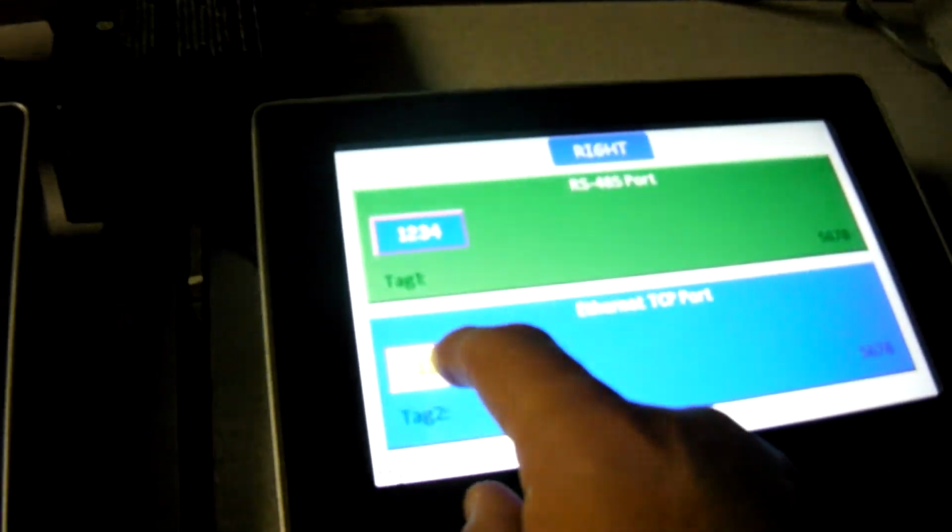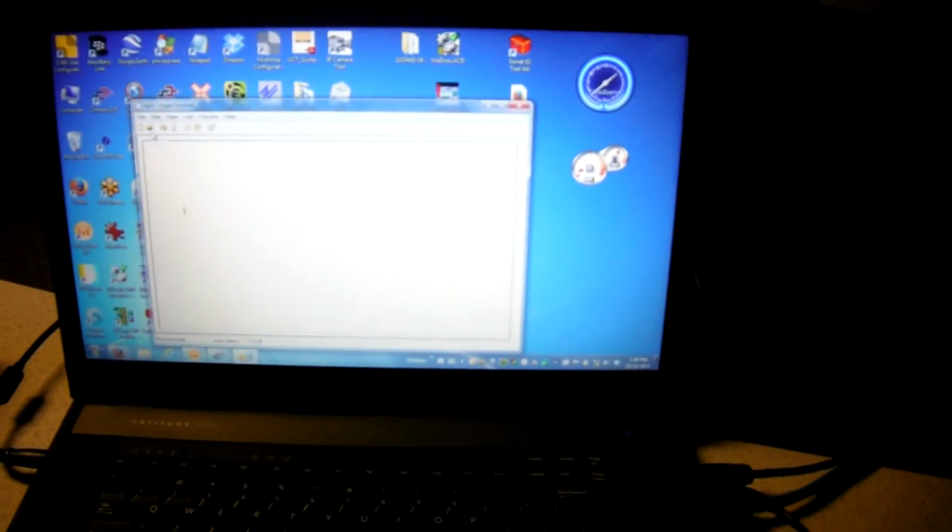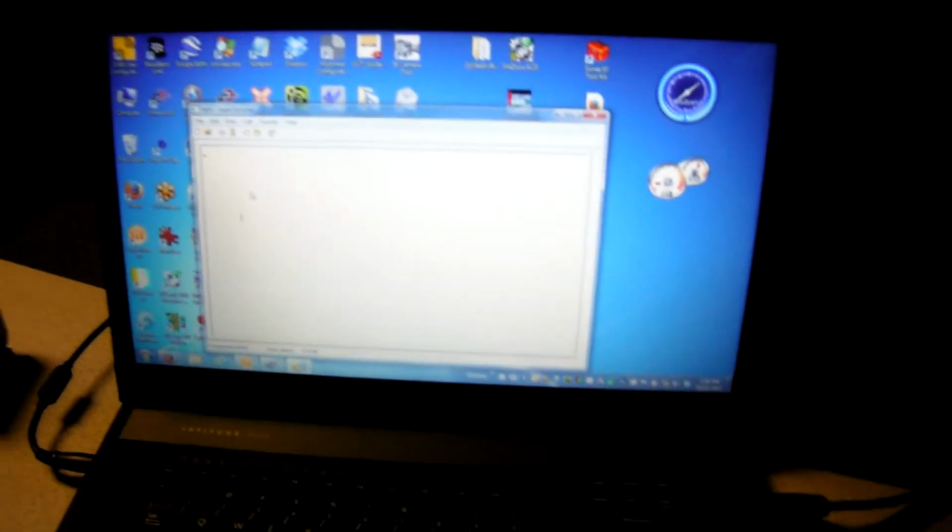All right, now I'm going to connect here. We'll see this thing's connecting, but I'm waiting for the other side to time out. I'm also going to change the properties so that the ASCII setup echoes everything we type onto our screen here. So let's try this again. Connecting. We'll go over to this one. Did I get something wrong? Here we go, we've got it connected now. I'm looking for the status down here to say connected.